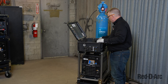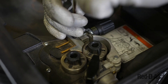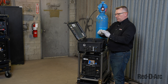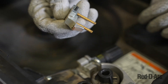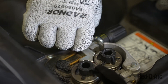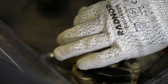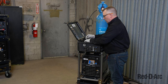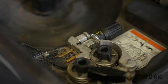The other thing I check is the wire straightener. The wire straightener is a part of the system that straightens the wire as it feeds through between these two brass units. I check to make sure it's not marked up, gouged up, or defective in any way, as that could potentially give you an issue while feeding the wire. I tighten that back down with an Allen wrench.